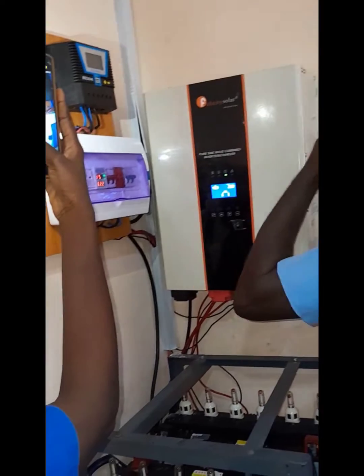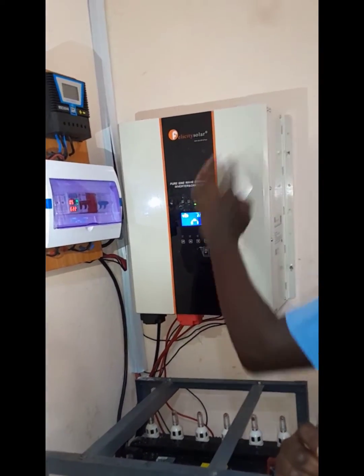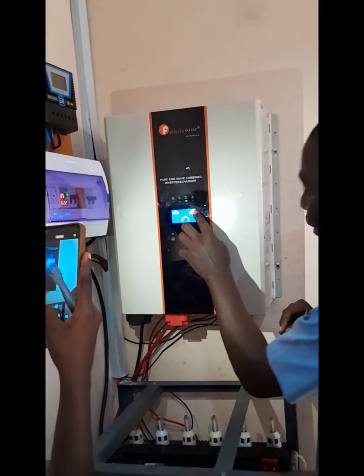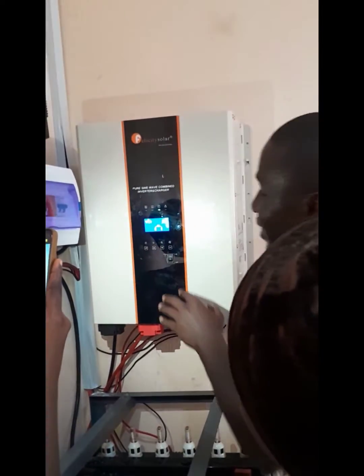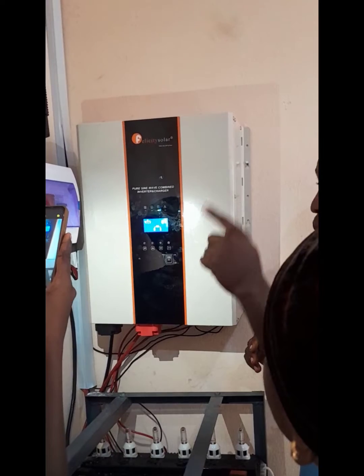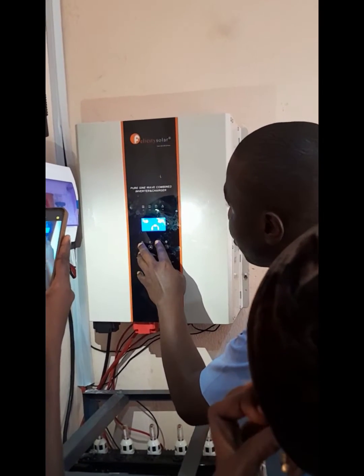On the AVC regulator you can see the input voltage and the current that the inverter is drawing. In some designs I can put the AVC regulator on both the input and output part of the load, but in this particular design I put it on the input part to control the input voltage. Felicity already has an internal mechanism that controls the output voltage — I set Felicity to bring out only 220 volts. That's the charge controller; I'm explaining it to the owner showing that you can see the voltage coming from the solar panel entering the inverter.